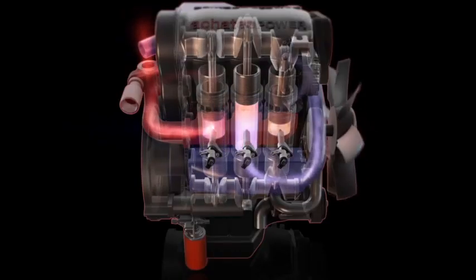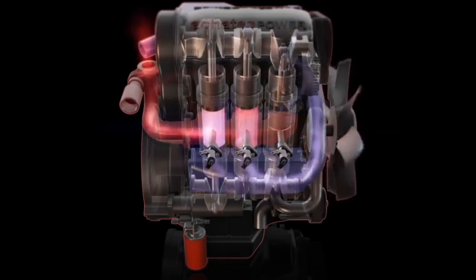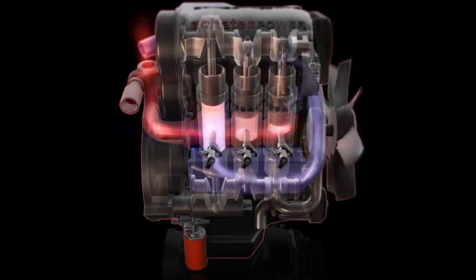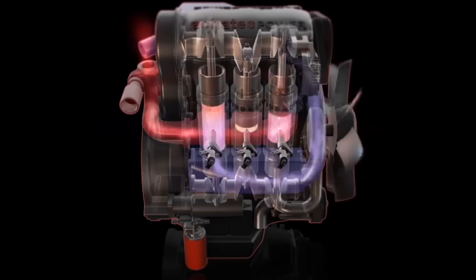Having a look at the engine, you'll see that two pistons move towards one another, meeting at top dead center where combustion then occurs. These engines operate as two-stroke engines, meaning every single time the pistons join in the center, the power stroke occurs, unlike four-stroke engines. The basics of how this engine works is fairly straightforward.